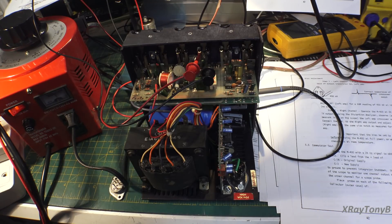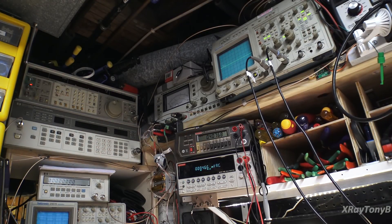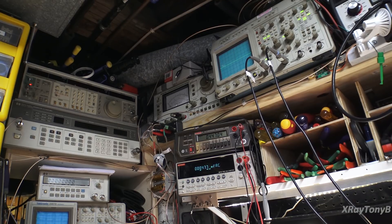And get the nice dimming of the lights as this thing comes on. At idle, we're currently drawing about half an amp. Our idle current right now is sitting at about 407 milliamps, and they want it to be about 450. Let's see if we can touch this up. Let's see if we can get it to move at all — there we go. I think I'm going to stop right there because it's going to creep up a little bit — a couple more millivolts — so we're going to leave that for a little bit and let it see where it settles.